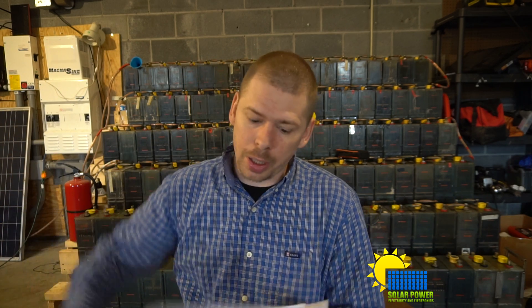Whenever you fill up your battery with water — if you're using flooded batteries — never use tap water or other liquids. I've got flooded lead-acid batteries over in the corner. Using tap water in a flooded battery will destroy it because the minerals in tap water destroy the battery. I highly recommend you build your own distillery. I pay every three months or so for about 25 to 28 gallons of distilled water for these batteries.